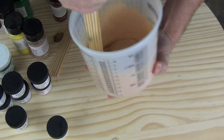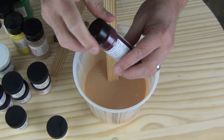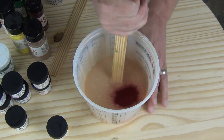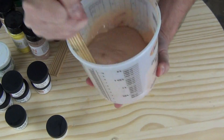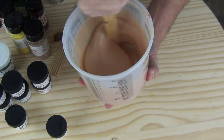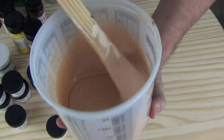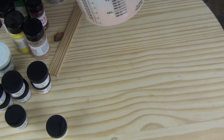Red is one of the more critical colors, especially if you're doing realistic living tissue — adding the red flocking really adds a lot of life to your paint scheme. The whole point of this is: the more realistic you can get that internal color of the silicone, the less paint is required to finish the job when you demold your part and start painting it. You want this flesh tone to be as realistic as possible, matching the lightest tone on your subject, so the minimal amount of silicone paint is required later. That way you don't wind up having to do 20 layers of paint on top of your finished part. And now our silicone is ready to cast.